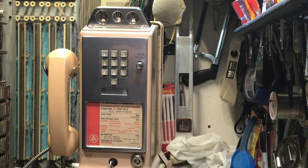I have a monitor speaker on the phone line, so the lower sounding tone you heard was the ringback tone and the ringing generator — the 105 volts that was actually ringing the bell inside of the telephone. You also heard the bell in the phone ring. So this is what the phone would have sounded like if you were to call it.